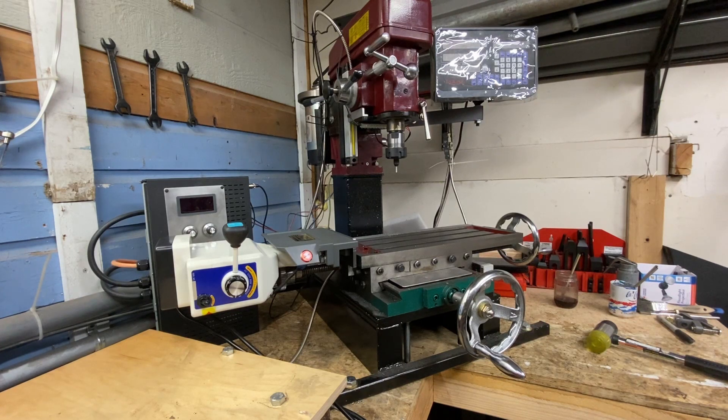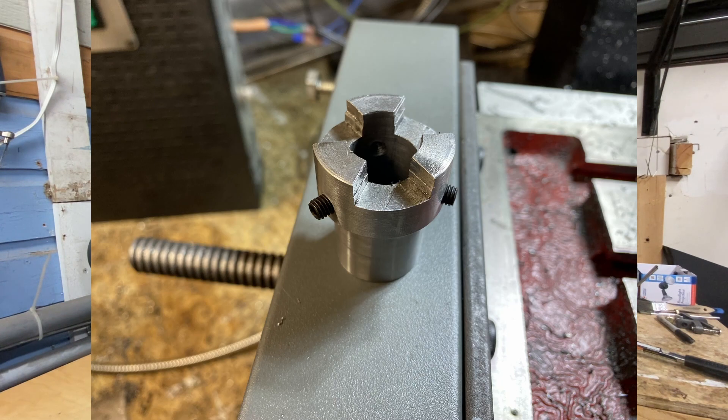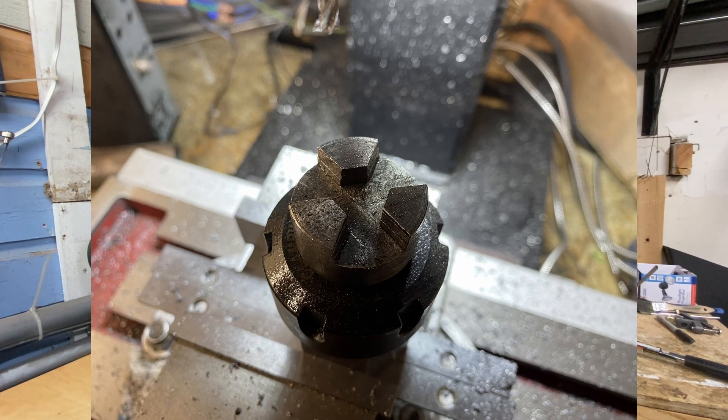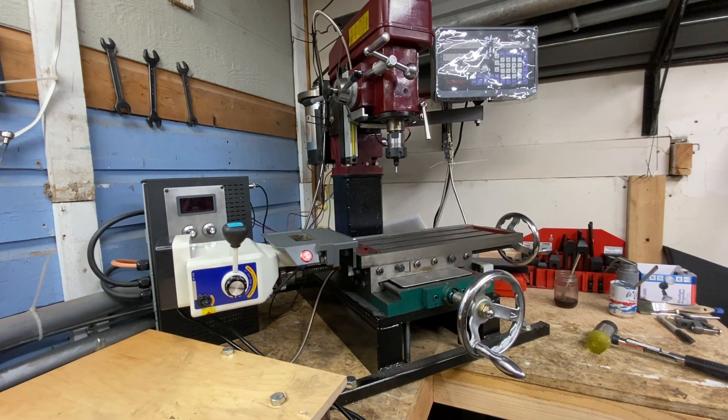This is my mill with the power feed installed. There wasn't a whole lot of fabrication in this project, at least not fabrication worthy of a YouTube video. I had to make a bracket — just some cutting and shaping, a couple of holes to drill. I did have to do a little machining to make a dog tooth gear. Ultimately, I machined it down to fit into a hexagonal collet block and then rotated the collet block in my vise to get the gear properly made.